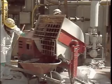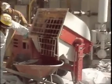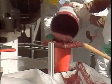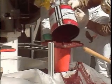When the Chockfast Red is thoroughly mixed, it is transported by way of a wheelbarrow or buckets to the pump base plate and poured. By using a funnel or grout head box, pour the Chockfast Red into the grout fill holes located in each compartment of the base plate. Continue to pour until the compartment is full.